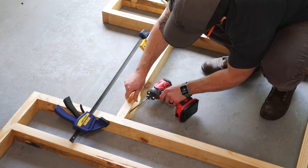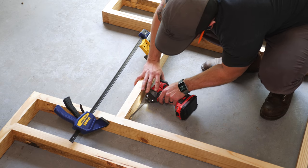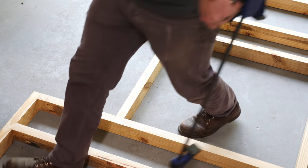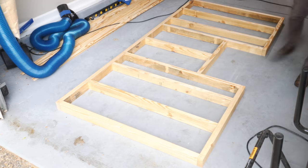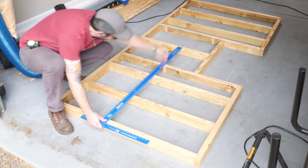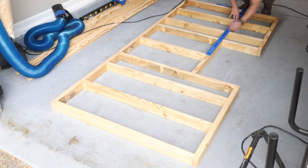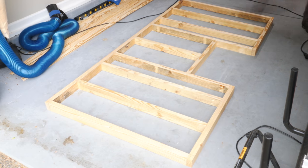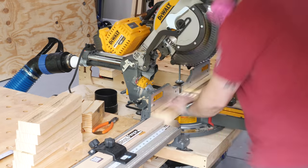When I added that centerpiece connecting those two sections, I had to get a little creative with my clamping, but I was able to get it worked out. With the main framework assembled, next I needed to come back and add some blocking. This blocking not only makes the framing sturdier, but it'll also give me something to drive the screws into when I add the T-track to the workbench top later.